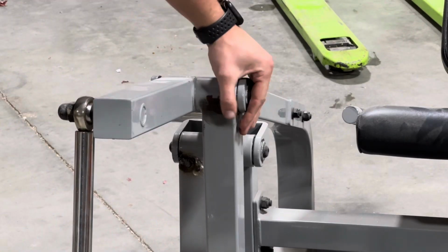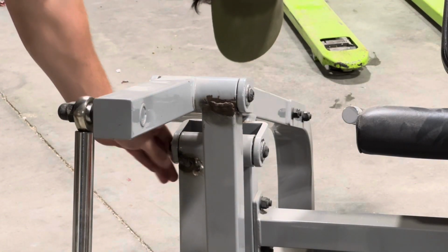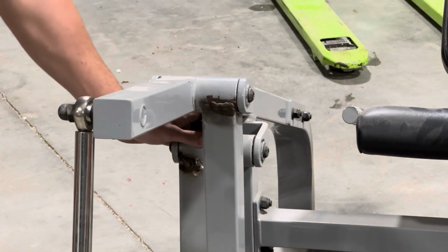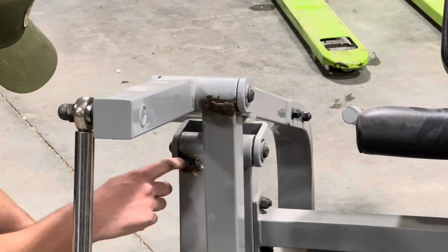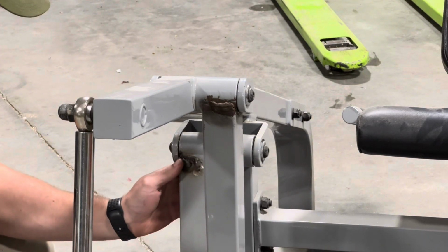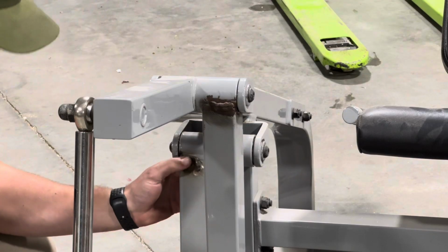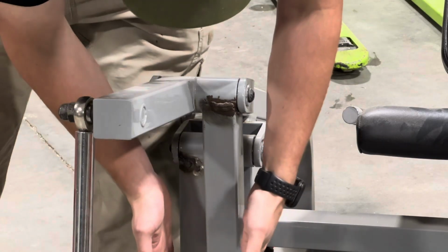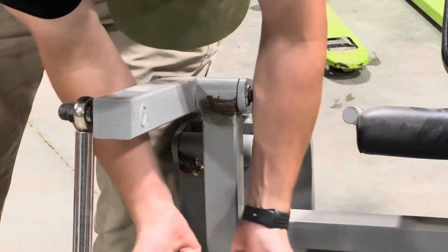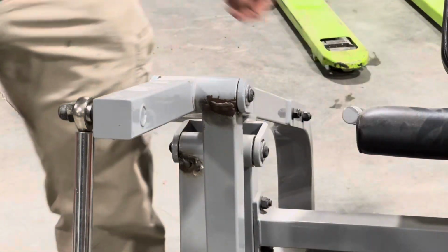So you can see here and here where he did his repairs, this weld cracked on the original construction, and this weld cracked, and his new weld actually also cracked right here, but the welds really don't look that good. Neither of them do. So you can see that they've both bent into where they're scraping now. So both of them need to be moved away again.